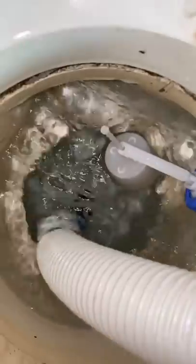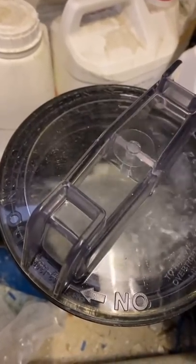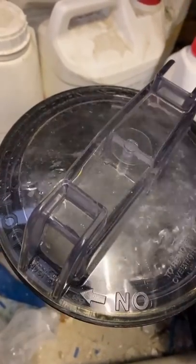Then I'm going to get my vac set out, plug the hose on but I'm not going to prime it — I'll just put it straight into the skimmer so I can show you what happens. Basically the pump's then got to suck all the air out of the hose, it then deprimes the pump so I have to wait for it to prime itself back up. It's not the end of the world but it just delays the job.